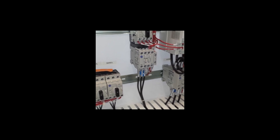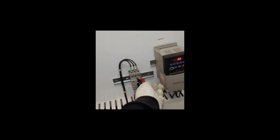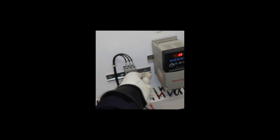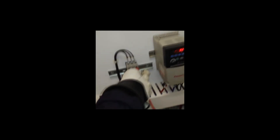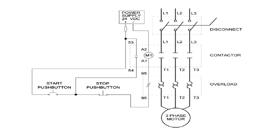Let's move on to the contactor. Start by checking from the top of the contactor for voltage — check phase-to-phase. By doing this, you are also checking the fuses and incoming line voltage. If the voltage is correct, turn the motor back on through the system controls and check phase-to-phase on the bottom of the contactor. If you're getting proper voltage to the top but not the bottom of the contactor, check for incoming control voltage. If you have incoming control voltage and incoming line voltage but not outgoing voltage, the contactor is bad. If you do not have incoming control voltage, the problem is not at the motor system at all.